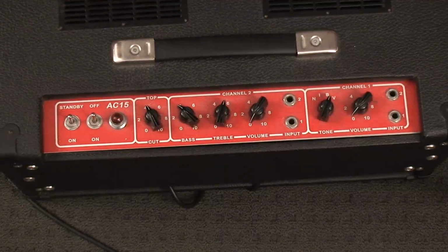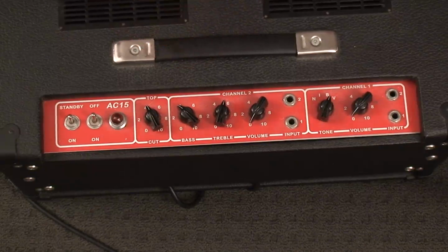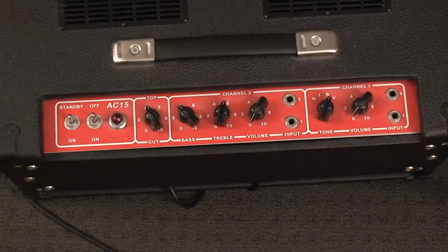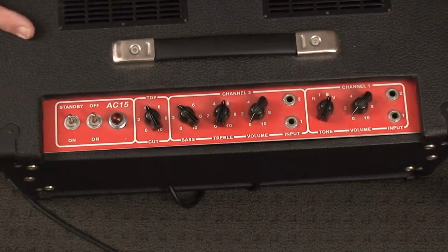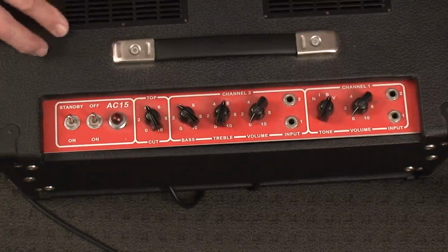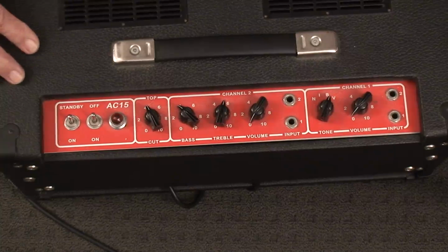Is there anything on the market other than this that's as versatile as this is? Well, some of the Vox amplifiers of the 15-watt category do in fact have a top boost channel as well as this. But there's one thing I would say to aspiring AC-15 and indeed AC-30 fans: because of the circuit and the way it's arranged, there's no feedback around the output transformer. What that means is that the sound that it generates is critically dependent on two things. One is the output transformer. You can get an output transformer for these things for $30, or you can get them for $400. And I didn't think there'd be much difference till I put a Mercury Magnetics output transformer in, and it transformed it from being rather thin and brittle sounding to producing the sound that you'll hear on the sound files now. It was a really good investment.